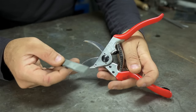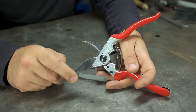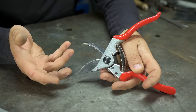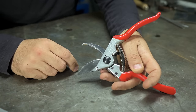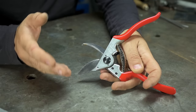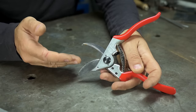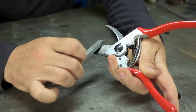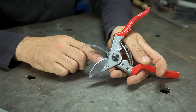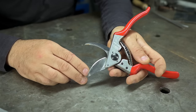So then if a small stone is all you need, what's all the hubbub? Well, I appreciate you asking. Allow me to explain. This is a curved edge, and freehand sharpening a curved edge can sometimes be complicated. Over time, unless you're a robot, as you sharpen, it's exceedingly likely that you'll change that shape. Out of the box, they're at some nice, consistent angle. A nice, clean bevel, stem to stern. Eventually, that bevel will likely be all over the place.